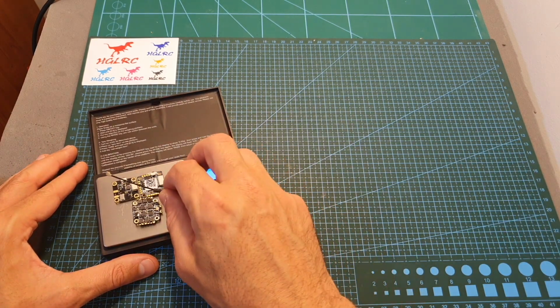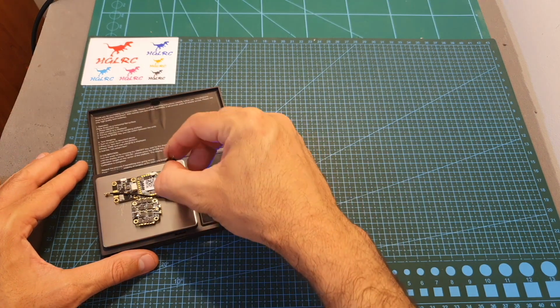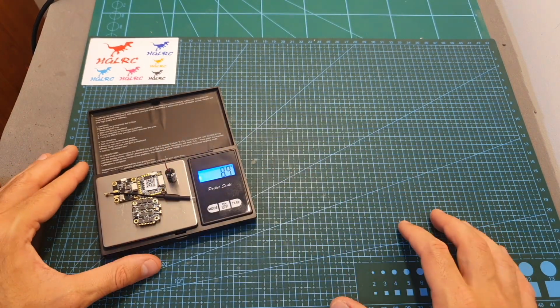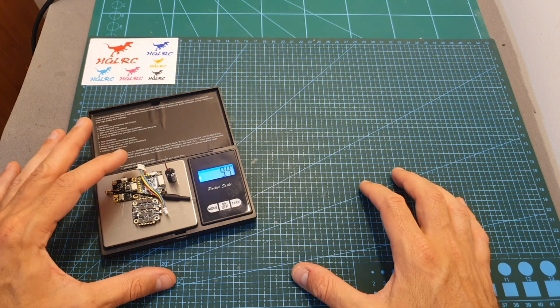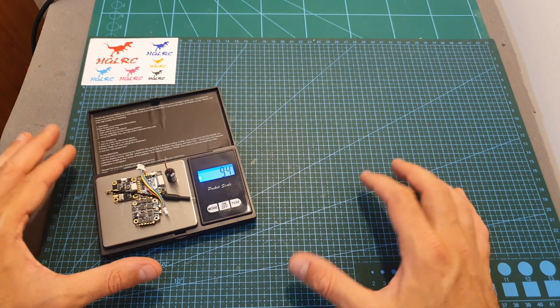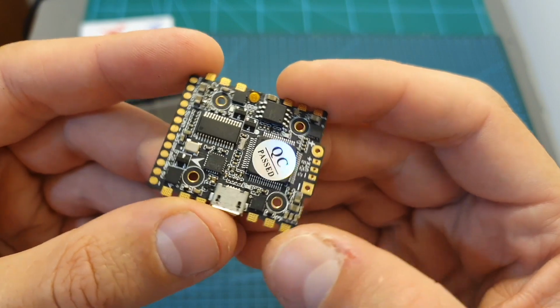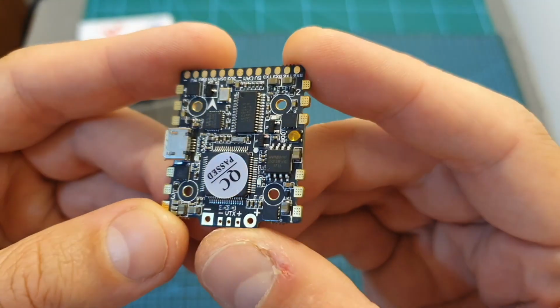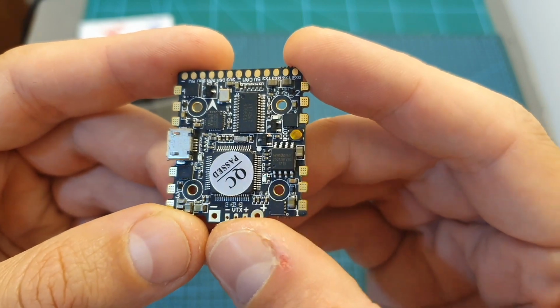After adding the linear antenna, the weight is 8 grams. After adding the capacitor, the total weight is 8.9 grams. And the weight, including the harness for connecting the 4-in-1 ESC and the flight controller, is 9.4 grams, so that's pretty light for a 16x16 stack. In comparison, the weight of the HGLRC Zeus, which is an F4 flight controller with an integrated 4-in-1 BLHeli 15A